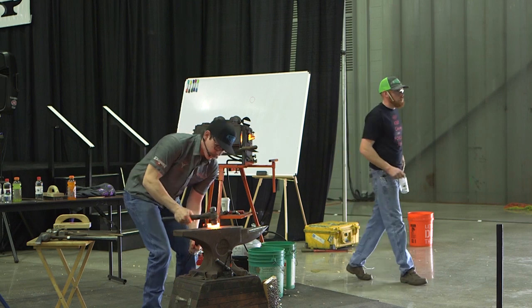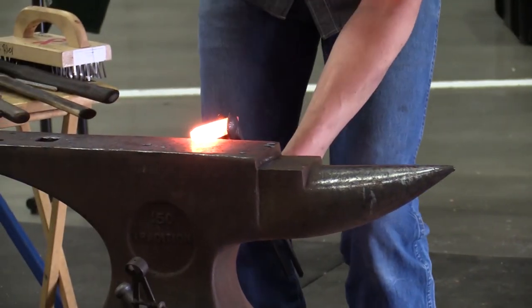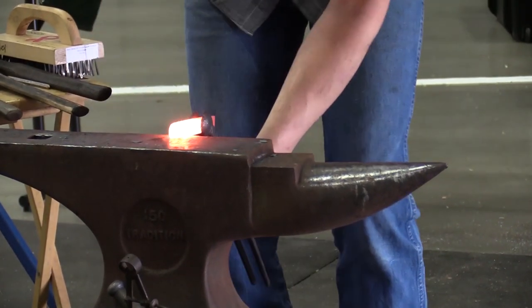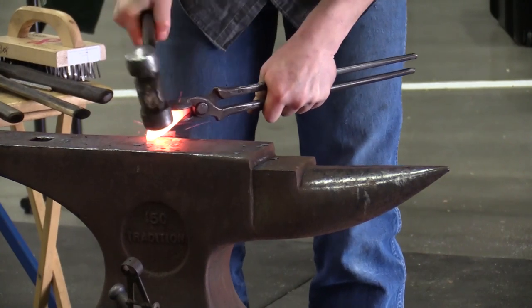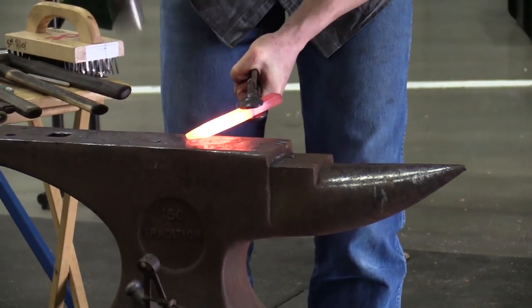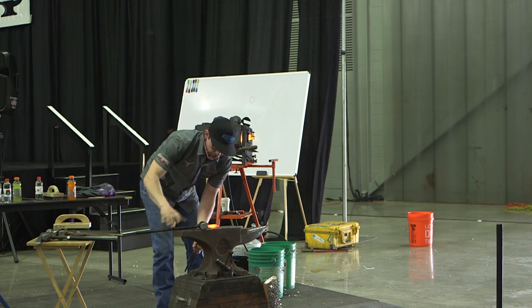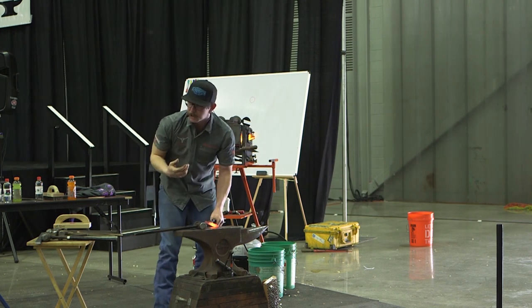Now I'm going to go to my 5/8 mark. Do my set down, start picking up, start coming in to myself. Now this one's going to be pointy, and so I'm going to come in to myself here too. Always good to come back to myself, so I have a strong pair of tongs. And also, I don't want it to get too long. If I just went at it real fly-handed and let the nose of my hammer go out too, well, I'm going to squirt things out. But if I start at the end and pull towards myself, it's going to come back to me.